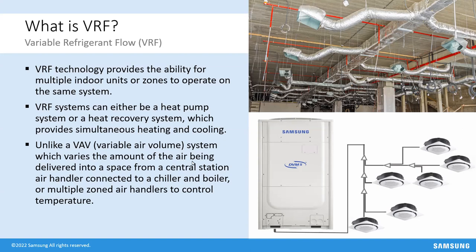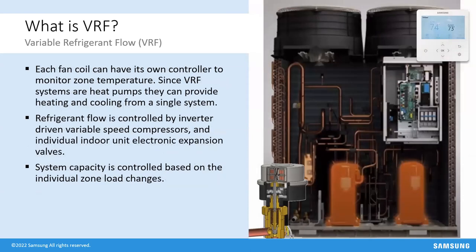The difference between VRF and VAV: VAV means Variable Air Volume — we change the fan speed and open/close dampers to control airflow. But it's still a single unit that can do one thing: provide either hot or cooled air, only varying the volume. In a VAV system, the outdoor unit doesn't know what the indoor boxes are doing — it tries to push the same amount of air but less is getting into the space.